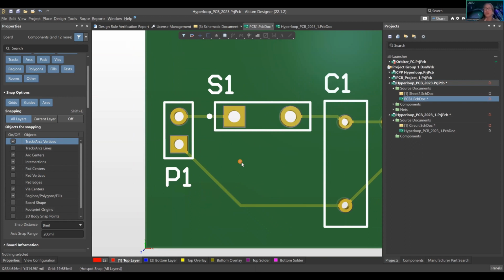That's a whole conversation when you get into testing protocols, like highly accelerated stress testing. For example, they'll put this board into a chamber and shake it like crazy. Then there might be solder joint issues, or maybe a component is too heavy and we need to stake it, which means adding a piece of glue under it so it doesn't wobble and go crazy.